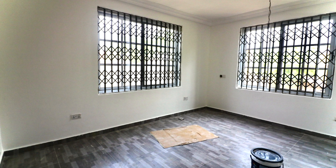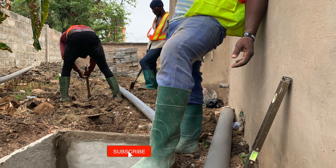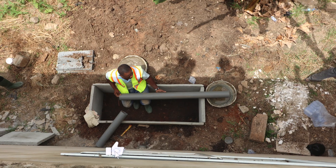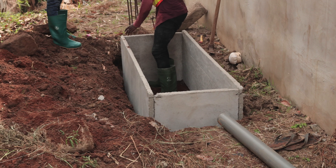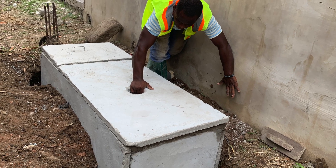Because there's a bigger plan for the homeowner and they are going to construct the top floor, which is where I'm standing right now, we thought it best to get two biodigesters, separate them, and do a soak away — a traditional soak away — just to serve the two of them. We did the usual standard family size biodigester, designed ideally for two or more bedroom houses — two toilets, three toilets, or even one bedroom. It still doesn't matter. We did two of them.